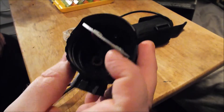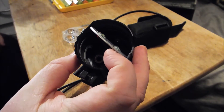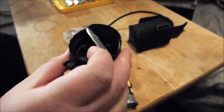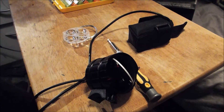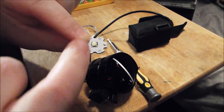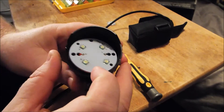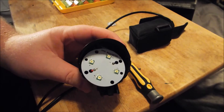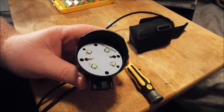You can see the driver in there. For most of you this won't really matter, but if you're OK at tweaking it, I would suggest de-doming it. This is a cheaper Lattice Bright LED that you've probably seen before inside fake lights — that's the dome there, I basically just took off that piece of plastic. I would definitely also change the gauge of wire in there — if you just change that to a bigger gauge wire, straight away you're going to get performance improvements. I would almost guarantee that.